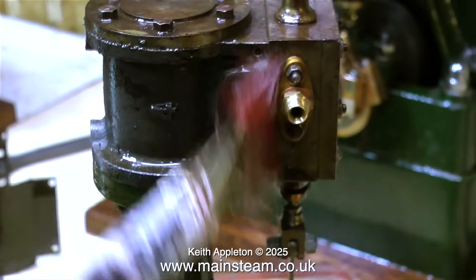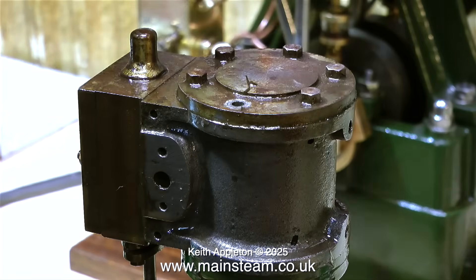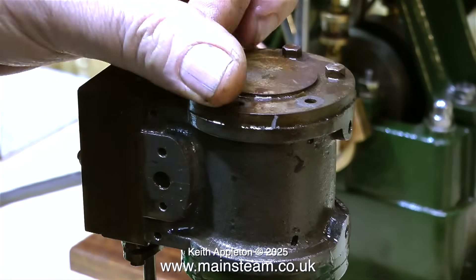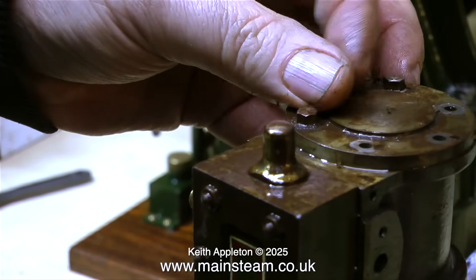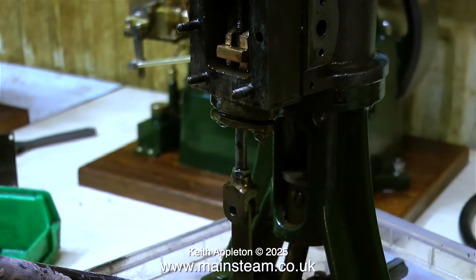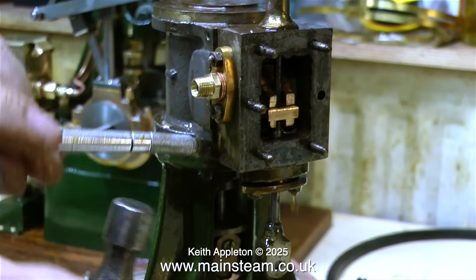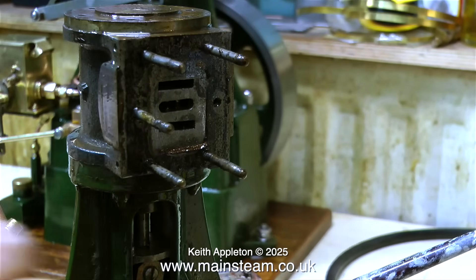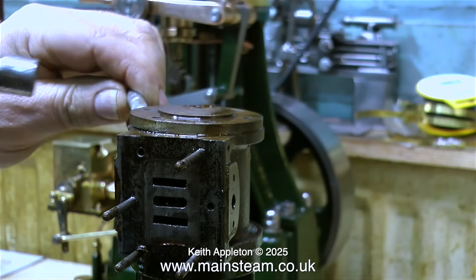Now the piece of cladding has been removed, I'm brushing some white spirit onto the cylinder to get rid of any oil and grime. Once I've removed all of the cylinder bolts I can remove the cylinder cover - as you can see, the varnish is stuck to the bolts but it's not very well stuck to the cylinder cover. I would think this engine looked really good when it was first made with its nice green paint, hand lining, and varnished bright parts. Now I'm removing the eccentric rod from the valve fork. I'm using a craft knife and a very small hammer to just separate the steam chest from the main cylinder block. If you're hammering on high tensile blades you must wear eye protection. Once I broke the seal it was easy to remove the steam chest, and now I'm doing exactly the same with the cylinder cover.